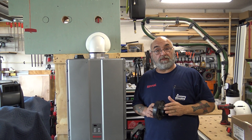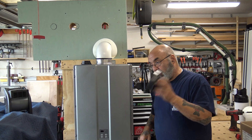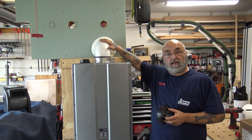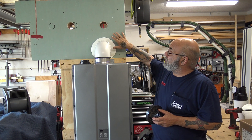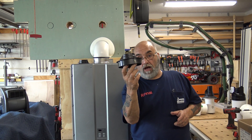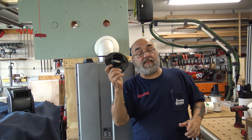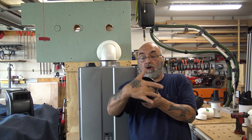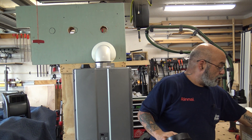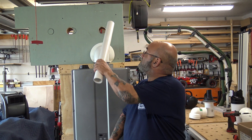This is going to be the venting of the RUR Sensei unit. Once you have all the piping, gas, electric, water pipes, condensate drain line, and relief line plugged in, we've got the venting. What we have here is the concentric venting — that's the one pipe that goes through the sheetrock and through the outside of the house. This fitting is included on top of the unit. On this side, which is the fresh air, you have a cap. This adapter goes from the concentric, closes off the air intake, and just lets the gas out. This is the piece where you can use two-inch schedule 40 PVC — that's what those two holes up top are for, for the next type of venting.